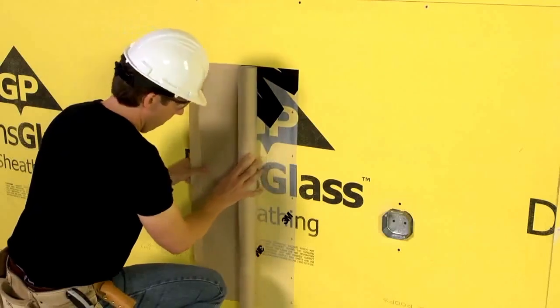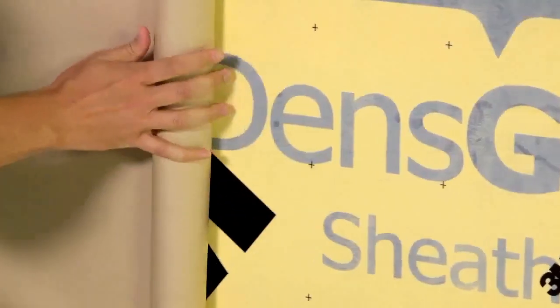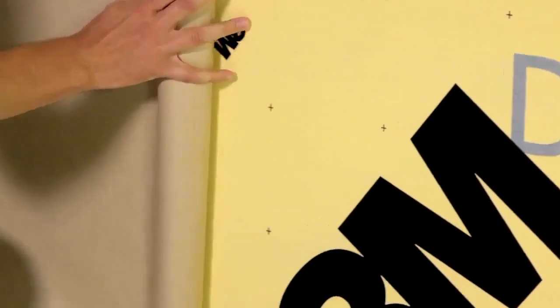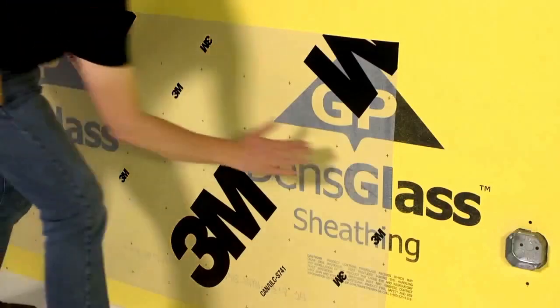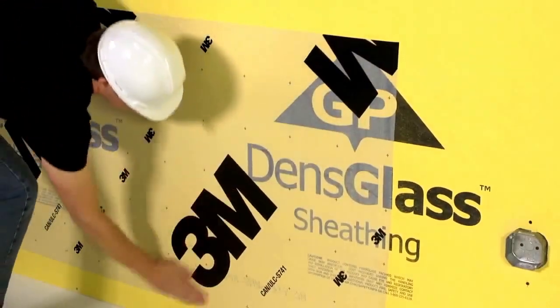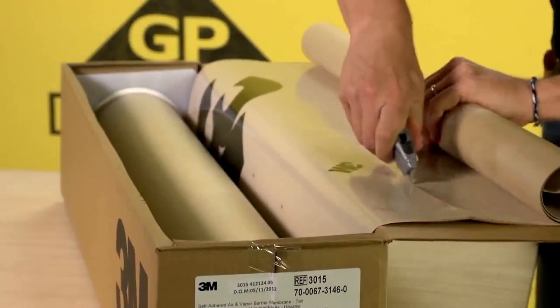Begin unwinding the roll while simultaneously pulling the release liner. Maintain pressure against the wall to tack the membrane in place. Continue across the wall. To smooth the surface, wipe the membrane with a feathering motion from the middle outward. Unroll and cut your next length as required for the application.